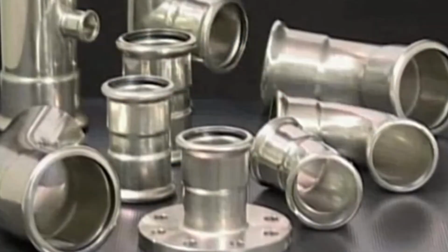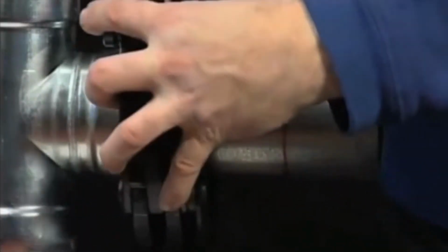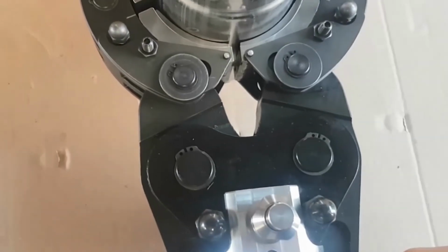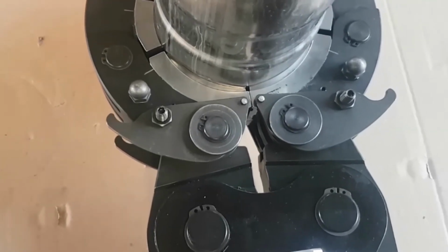The larger bore reduces velocity, frictional loss, and in a pump system can reduce energy consumption whilst maintaining a comparatively similar physical size pipe. On top of this, you have the well-known Europress benefits of a modular piping system, meaning you can assemble the pipework prior to making the final join, allowing for any last-minute adjustments.